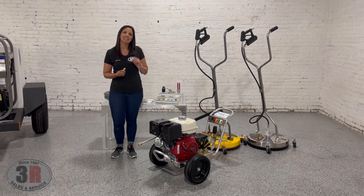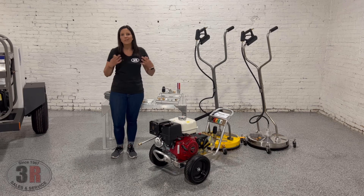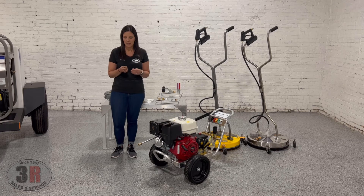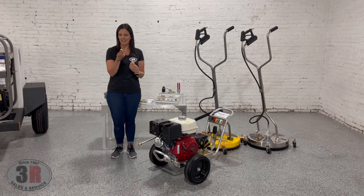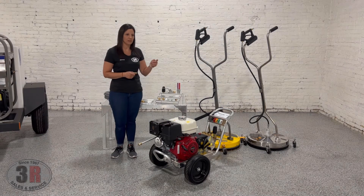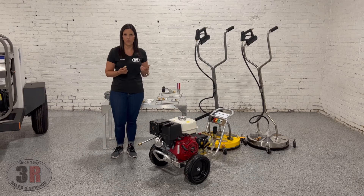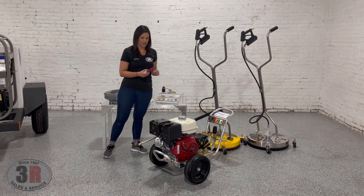The piece I dropped is our nozzle cleaner. On your surface cleaner you have tiny little nozzles — they're basically half the size of your regular high pressure nozzles — so they can get clogged every now and again. This particular component has a cap that comes right off; it only has a wire in there and you'll just clean out that nozzle real quick. If you run into any snags you might have to unthread that nozzle from your surface cleaner and clean it out that way as well. It works on both your regular pressure washer nozzles and on your surface cleaner nozzles.